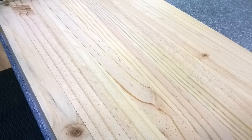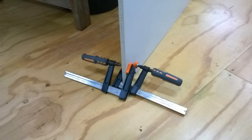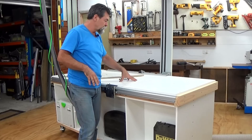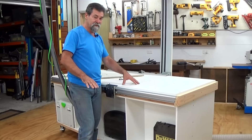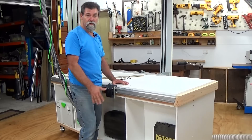I've got pictures of the frame there - you can see it all screwed together. I've got pictures of the torsion box. The thing with the torsion box is that it is two skins separated by a framework in between - a sandwich. Because they're separated, if you push load on the middle of a torsion box, it's trying to stretch the skin on the bottom, and there is no stretch in it. You'll tear it before you'll stretch it. So these things are horribly strong - unbelievably strong. It looks lovely. It's got a lot of potential for drawers and storage for timber in there as well.